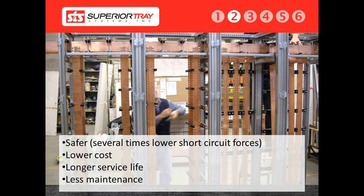which provides no field cancellations. Because of this, a bus duct system must be heavily braced to withstand the forces created by the conductors during a short circuit situation, whereas a cable bus requires less bracing. This means that a cable bus is much lighter than a bus duct, requires less supports, and is easier to install. As a result of the lower forces on conductors, a short circuit event is not near as catastrophic to a cable bus as it would be for a bus duct.